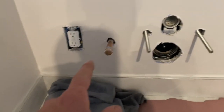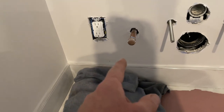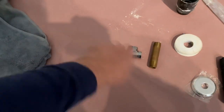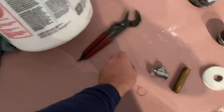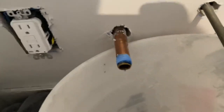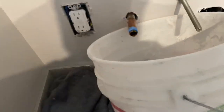We're going to start with the water supply. I already made sure that the water is off — we may have some residual water there, so I have a towel. I'm going to take that off and add an appropriately sized nipple with the shutoff valve and isolate that. Cap is off. There's a little bit of residual water catching into the bucket, then I'm going to take this nipple out. There's no more water left.